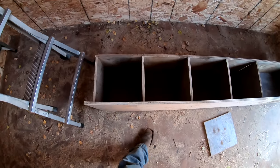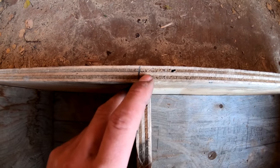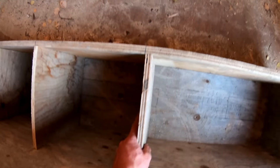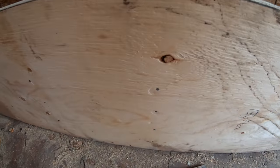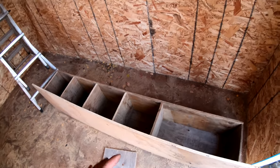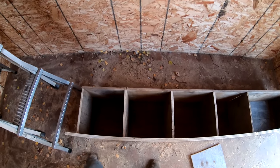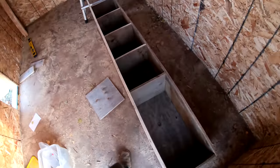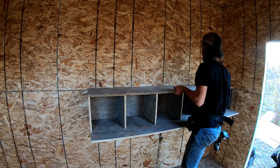Here's how things are looking — apologies, lighting in here isn't great. I mark 12 inches from the inside and then make a mark on the top and bottom, line it up, and as I nail, making sure it stays nice and straight. I'm nailing both the top and the bottom, and then I'll nail the back in as well, so it'll hold very nice and straight. I'm not getting too meticulous about this — just throwing it together pretty quick. If it's not perfect, it's not perfect; it's still going to look nice. So we'll get these last two put in and hang her on the wall.